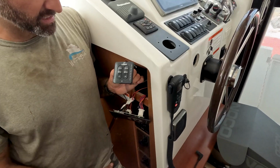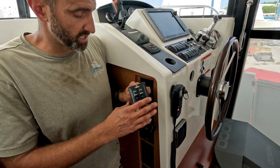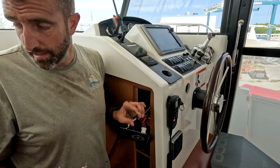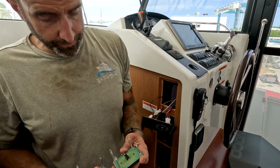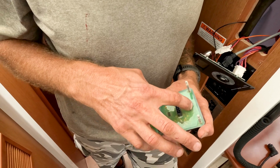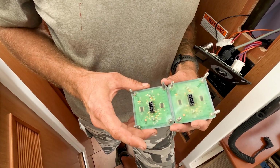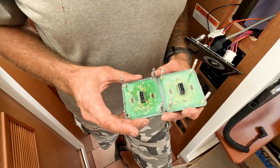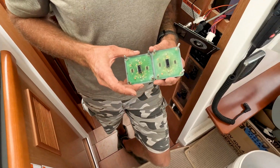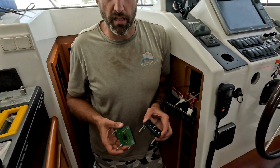It's going to be good. It is a little intermittent, so I'm going to see if they want us to just get two switches, because this one's been out in the sun for a little bit. Aesthetically it doesn't look all that great, but surprisingly, if you look at this, it has gotten kind of cloudy in the resin there. It could have gotten some moisture in there, shorted out the LEDs, or ruined the control just enough that the lights don't work. So now we're going to order them a new one. When the new one comes in, we'll install it and they'll have lights.